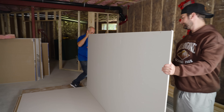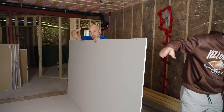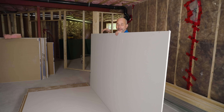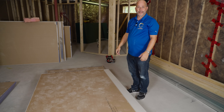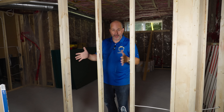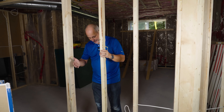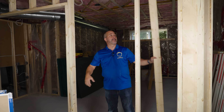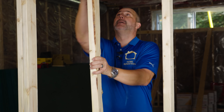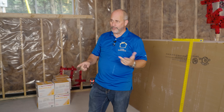When you set the board down, the reason this works so well is that as it falls, it traps the air, and that trapped air becomes a cushion that makes a nice soft landing. Just as it's about to hit the other piece of drywall and you're thinking it's going to break — it just grabs it. Piece of cake. When you're receiving your drywall order, you should have your wall frame up. You'll find there's not enough space to carry drywall through in a lot of cases. Take a reciprocating saw, cut through the nails on the top and bottom, pull the stud out of the way — now you've got a walkway. Don't spend all day walking around obstacles. Remove a stud and screw it back later. Two rules for drywall: one, try to install your ceilings first. It gets material off the ground and you can't really install all your walls if you're buried in drywall.